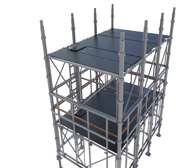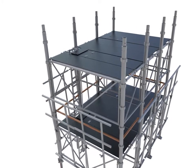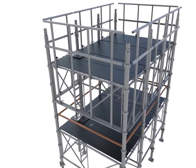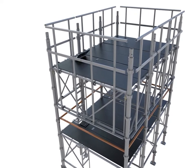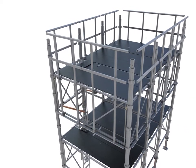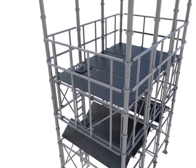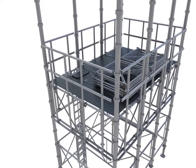Once all the frames are connected, the vertical restraints are released and the advancing guardrails are lifted to the next frame position and secured. Append and add the next lift of Alshor Plus legs, locating onto the spigots. Continue this sequence until the desired height of table is reached.